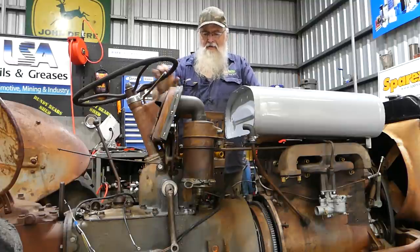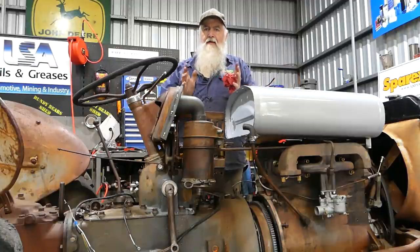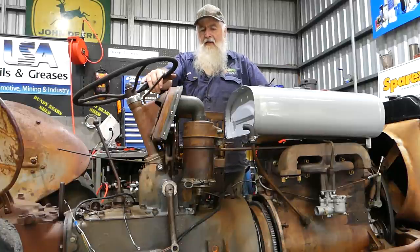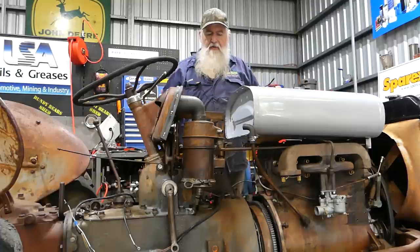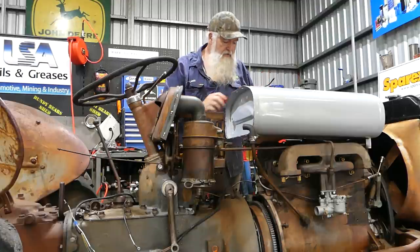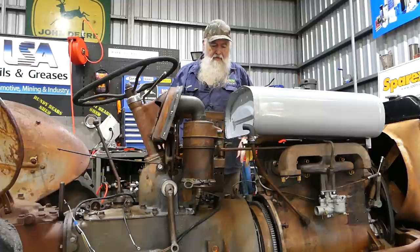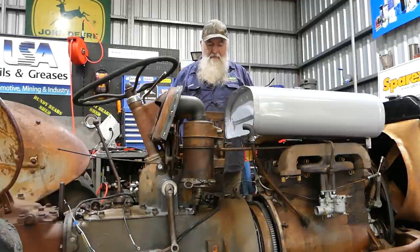I've got the camera down there and we're looking at putting our tractor back together. I've brought the tractor close enough that we can start talking about what we need to do to get it back together. The first thing to touch on the tractor is this throttle rod - as you're coming closer, try and make sure everything is lined up as good as you can by eye. I've just fed that in and I'm probably a hundred to a hundred and twenty millimeters apart.